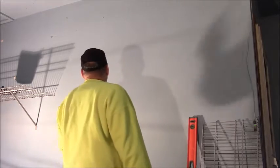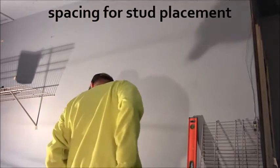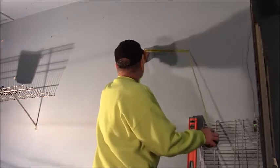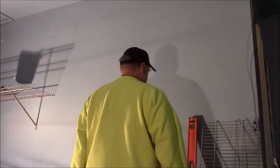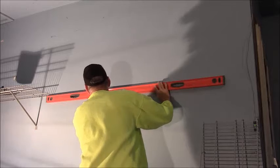I'm going to mark it on the wall. And then I can go 16 inches off of each one and find the next stud. So I'm 16 here, and I see two more nail pops. Now the first thing I want to do is set my height and draw a level line.